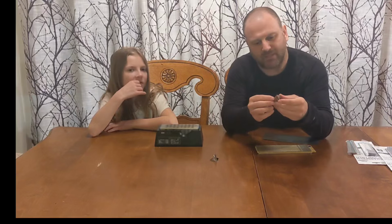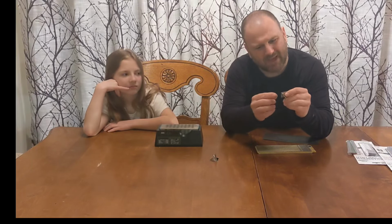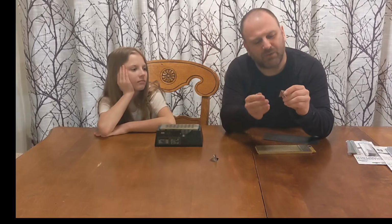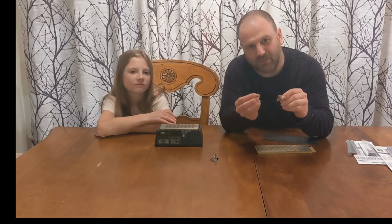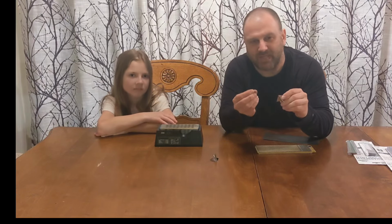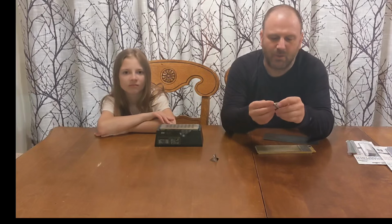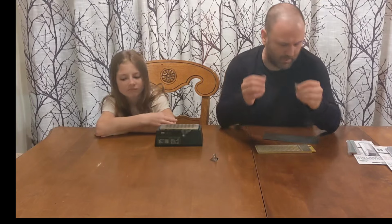The one thing guys like to do, they'll like to try to turn it into a 44-degree bevel to make it have higher perceived sharpness. Anytime you reduce the number of the bevel, you reduce the edge bevel integrity. There's an inverse relationship with edge bevel integrity and perceived sharpness. So 60-degree double bevel is where it's at.